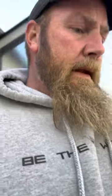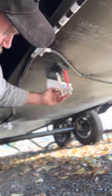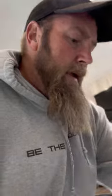Now we've let this drain for a little while. The next thing I'm going to do is come out here and close those sink valves that I opened earlier, and then close the low point drains. I'm going to leave the drain for the main water tank open throughout the winter to let everything completely drain. I'm going to leave the anode out of the water heater as well. Now the next thing we're going to do is take some of this RV antifreeze.